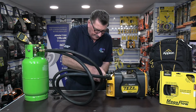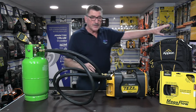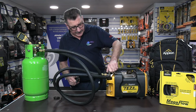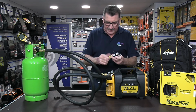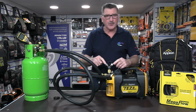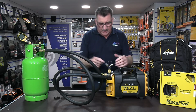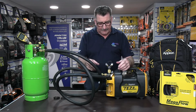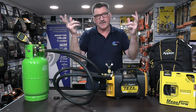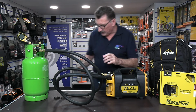to 3/8, okay? Now, if you had another system that you wanted to back out and you had enough length on the pipes, in theory, you could undo the 1/2 inch port, add another Speed-Y, and take another 2 sets of hoses to another plant if they're close together. Okay, so you've got unlimited features. Even with multi-port vacuum pumps, you can still add Speed-Ys on there to increase even more connections for the Megaflow hoses. Okay, now, so that's that one shown.